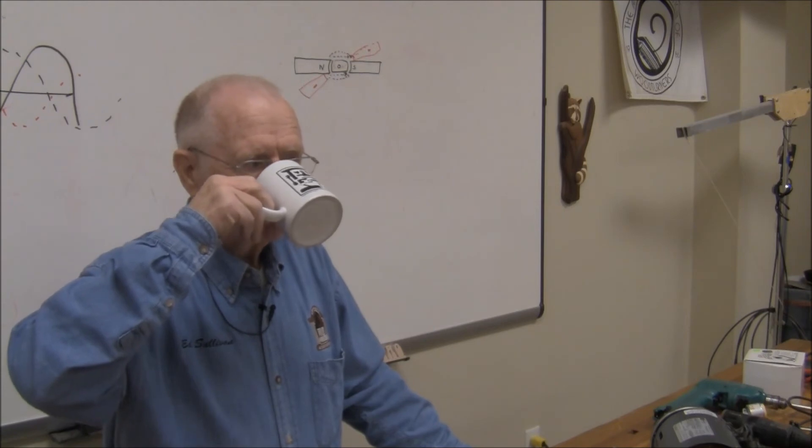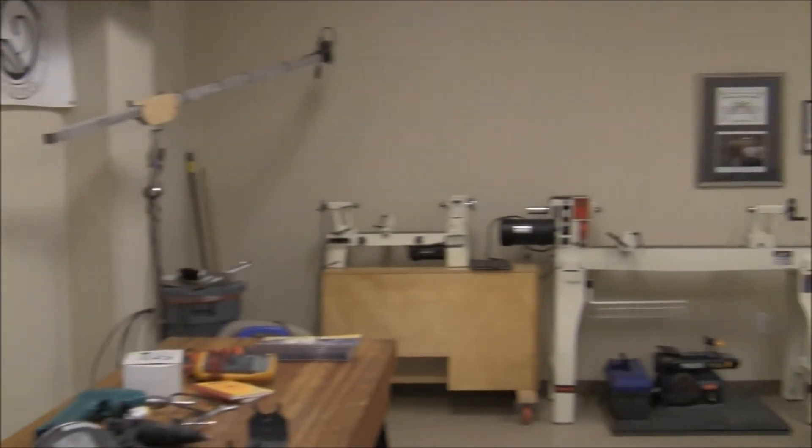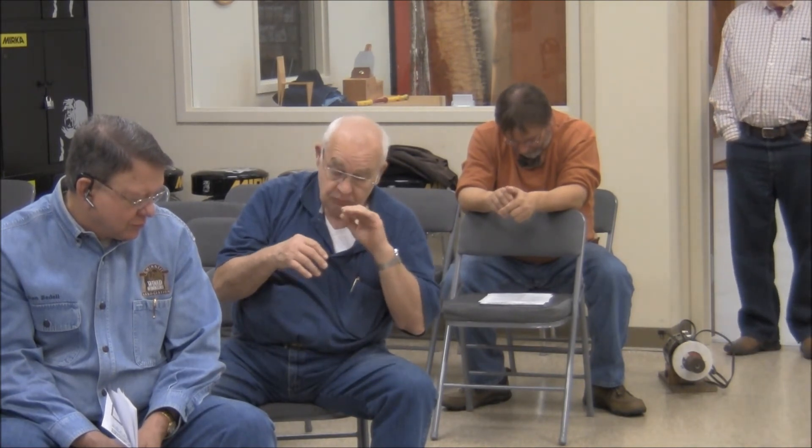An important point: if a motor is not running at its rated speed, it's going to heat up. On a table saw with a dull blade, if you're forcing a cut you're lugging down the motor. As the motor decreases RPM, it gets hot. A motor is also a generator — while running, it generates a back-EMF current opposing the applied current. With no load, these balance out and draw little current. But when you load it down, the back-EMF decreases and the applied current increases dramatically — you can burn up the windings quickly.